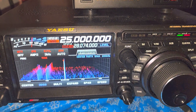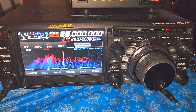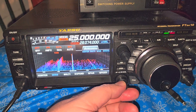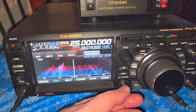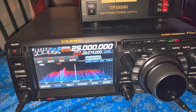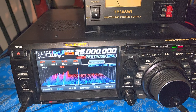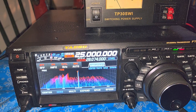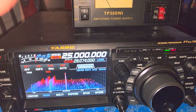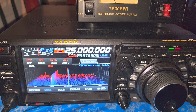If I switch off the notch, we're back to normal. This gives you an idea of what it's actually capable of - it's removing a single tone that could be undesirable in a broadcast, in a ham contact, or local interference creating a tone on a specific frequency. It's very tight, so it's very specific to a small amount of frequencies that are the tone you're trying to block. It's very nice for that.